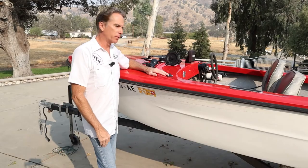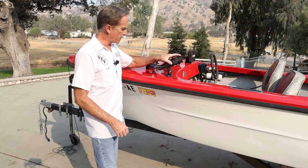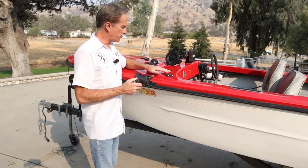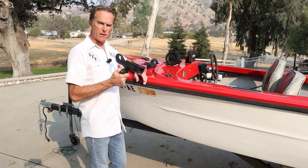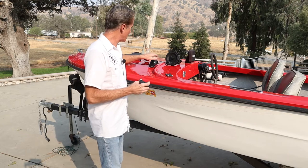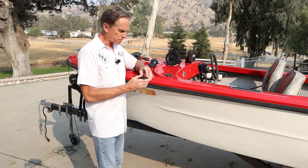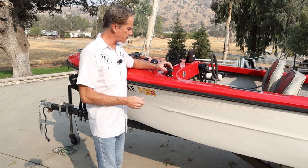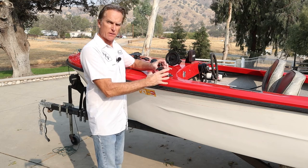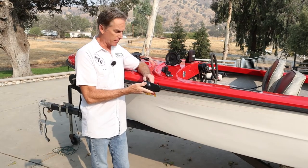I put these Atwood mounts on here for pole holders a long time ago and they've worked great. There are mounts on the boat that match these, so I'd like to figure out a way to keep using my Atwood pole holders. Unfortunately, the Scotty base doesn't match the Atwood — it's bigger and a little more heavy duty. So we're going to take this Atwood base out and put the Scotty base in its place. It's bigger and will cover up the hole. We also have to make a big mount underneath — some sort of plate — because this downrigger will be running probably a 4 pound weight.